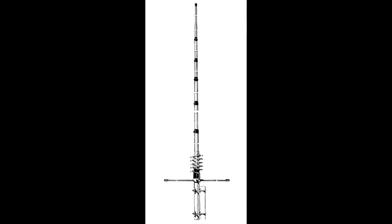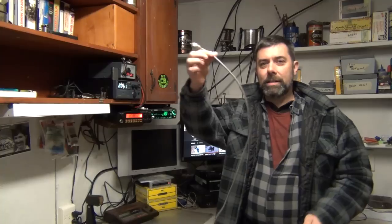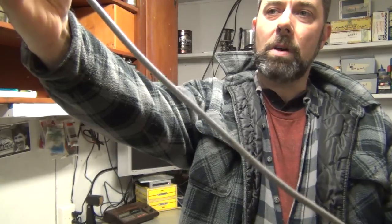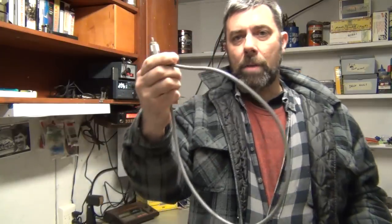The other half of this is cabling. When you buy an antenna, here are some pictures of different makes and models all in the normal price range for a regular pole-antenna base station. For cable, this gray wire is RG8 or RG8X — not bad quality, actually pretty high quality wire with nicely soldered end connectors. I use that as a jumper for my SWR meter. Comparing it to the thicker cable — that is RG213. There's also LMR400. These are more insulated, thicker cables, and they're high quality. This one is made for outside use with shrink tube and soldered ends.